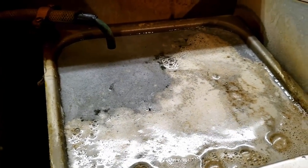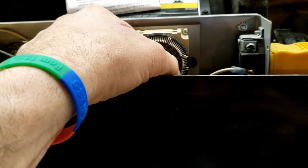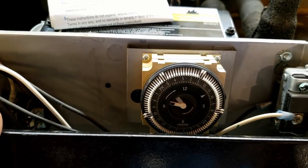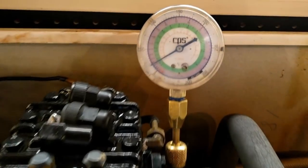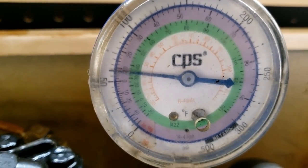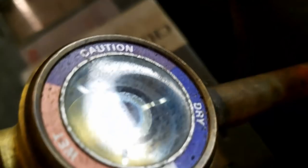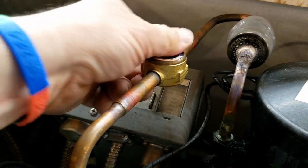I'm going to kick this thing out of so-called defrost. That pan is completely full — I can feel the heat off of it, hopefully it boils that water out. These condenser fans don't shut off during defrost, which is kind of wasteful, but it appears that's how they all are. 15 years ago they didn't conserve energy I guess. Setting it up for 5 defrost cycles, about every four and a half to five hours. It just kicked on — should be about 65 area — and had no problem at all. Sight glass looks pretty good; it was supposedly flashing a little bit the other day.